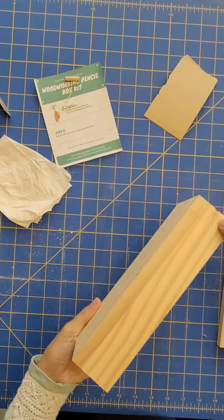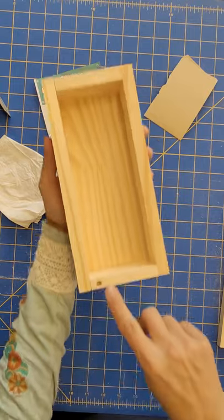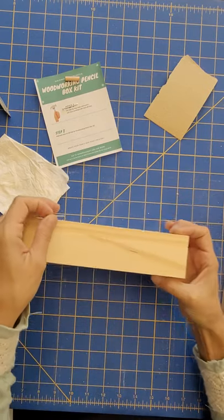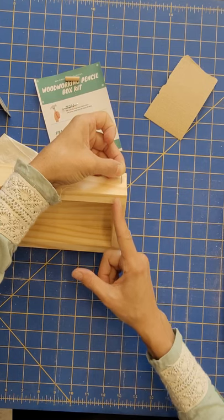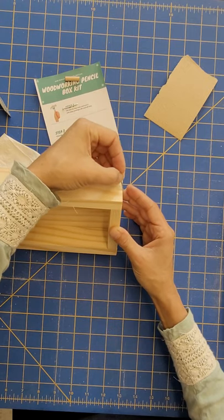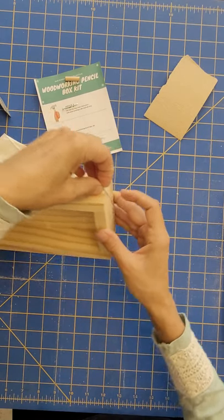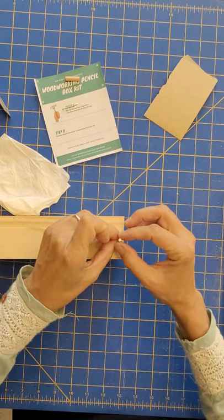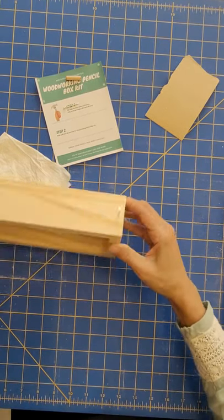I've got my two nails on this side. Now we're gonna work on this end and I've got two nails left. This end, I don't have to worry about any holes here, so I'm gonna go right in the middle here. If you wanna make sure that you go in the middle of your board, you can pick your spot and look at it like this — I'm looking for the middle of this end piece. If I'm over too far one way, I'm gonna poke through on the inside of the box. If I'm over too close to the edge, I'm probably gonna end up coming out the end grain and have a nail showing on the end of my box. So it's really important to get your nails straight up and down right in the middle line. That looks pretty good — I'm gonna hold it straight up and down and that nail looks really straight.